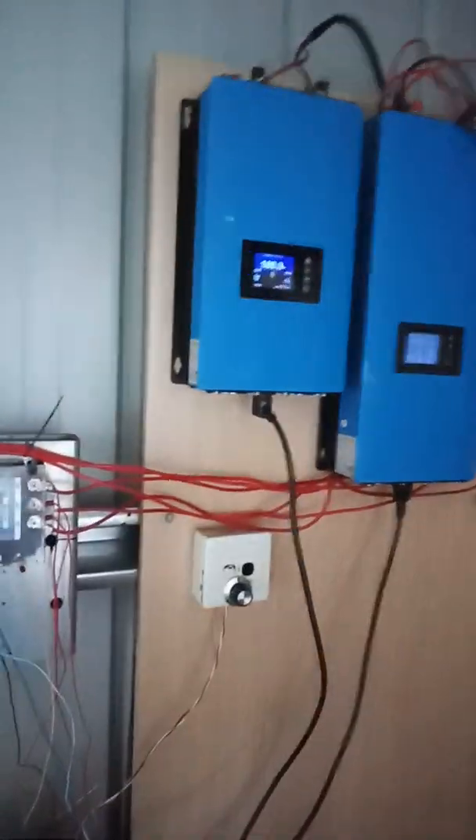You must not touch these ones. Once the brakes are on, do not touch them — if you do, you'll take the skin off your fingers, they get really, really hot. This one I think is a 2,000 watt. Let's see — yes, it's 1,000 watt, 20 ohm. So that's for a 48 volt turbine, not for a 24 volt.